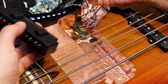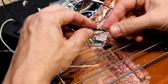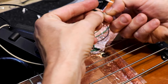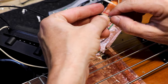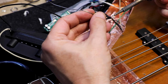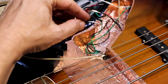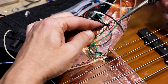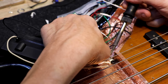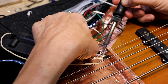Now it's time to solder the ground wires from both pickups, so we'll just twist them together to make them one. These are the black wires, and we need to solder them together. We do this right now, before we install the neck pickup, because it makes our lives easier. Now that they are connected, we're going to solder them to exactly the same spot where we disconnected the former pickups from the guitar.